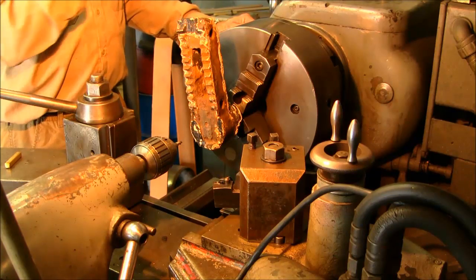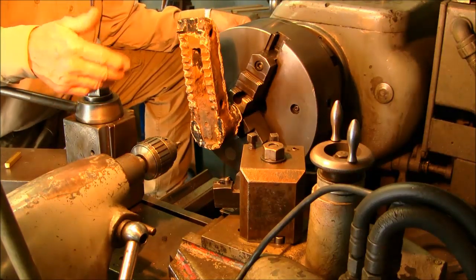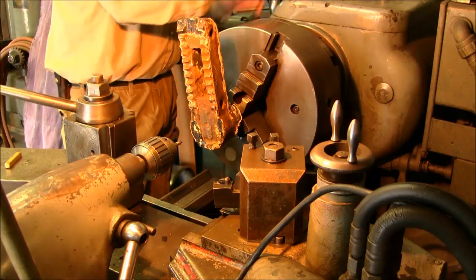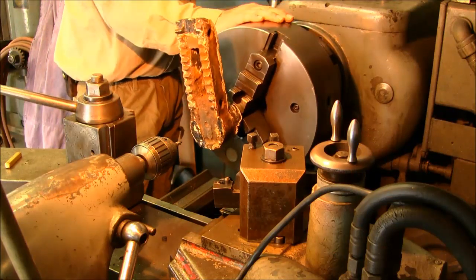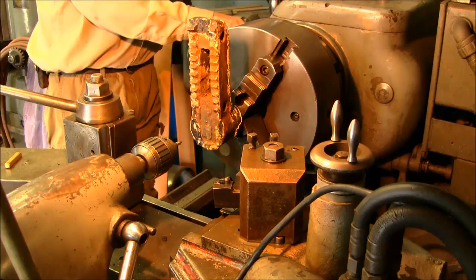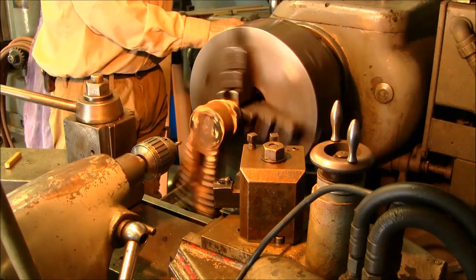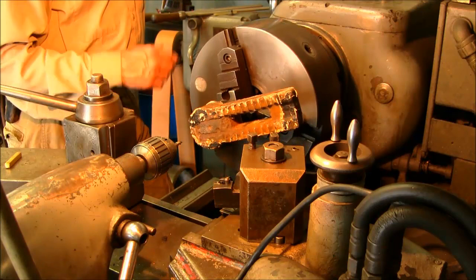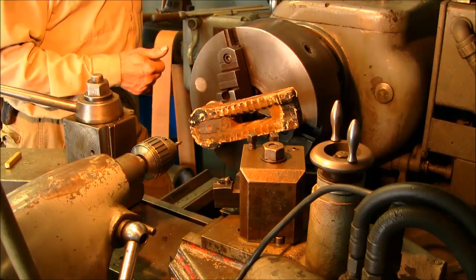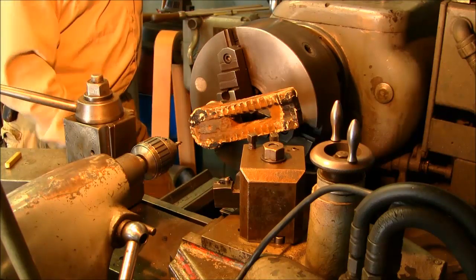I'm getting ready to rebuild the center section of the shop, and then we'll get the lathes moved in and get some good anchored down flooring going. So this is a little bit fast even. This is actually 308 on here, and if we brought this to neutral and had this brought out here, it'd be 210. We could swing it at 210. I don't see the light moving at all. But you want to be careful when you start swinging things off to the side. Your balance of weight is shifting back and forth, and you don't want to be causing excess wear and tear on your lathe. Just a tip there.